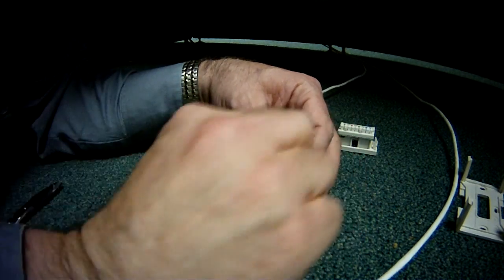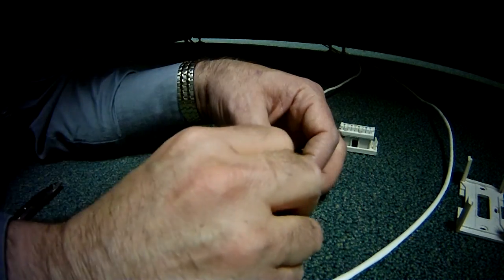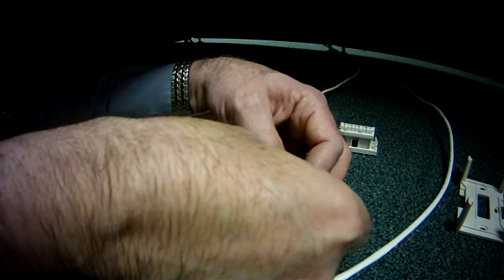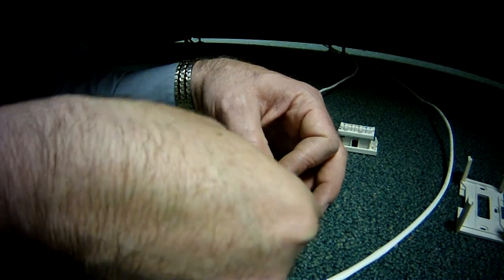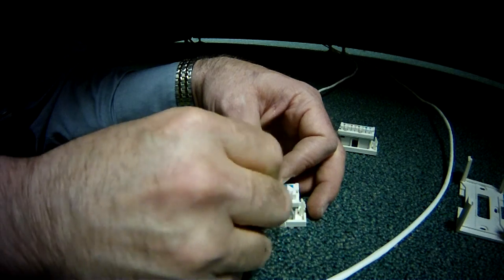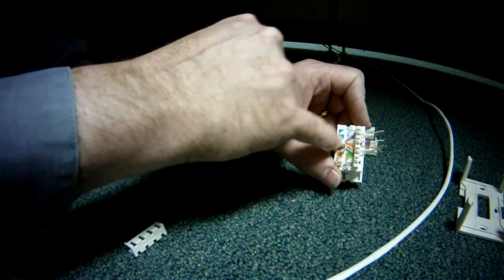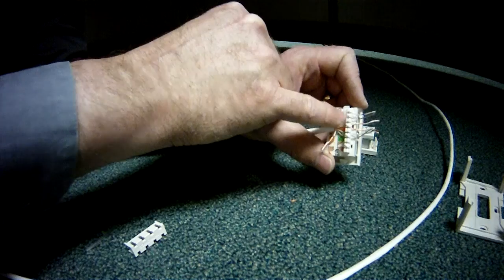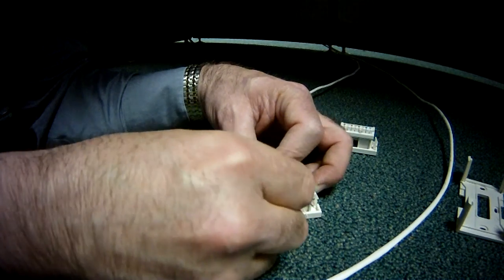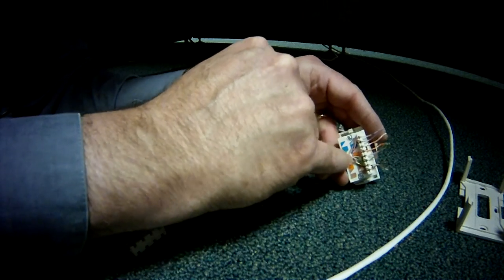This is kind of an acquired skill because the wires are already twisted and you need to get them untwisted to go on top of the punch downs. But you only want to untwist them the minimal amount required to get them onto the punch positions, because you don't want a large gap of stripped jacket between where it ends and where the punch-down terminals actually begin. You want the shortest possible distance between where the jacket ends and where you punch them down.